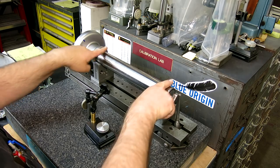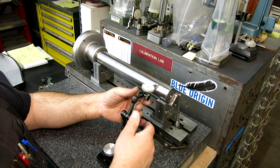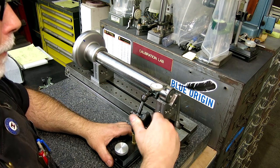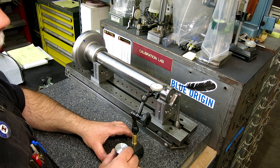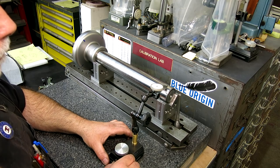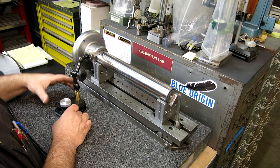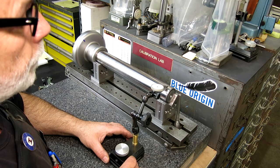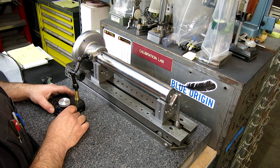So right now, what I want to do is go over the top of the pin and make sure it's parallel with the base here. So let's go ahead and do that. Use my little handy dandy converted semi noga deal here. All right. Find the high spot right there. Zero up. All right. Let's come down here. Okay, so that's plus two, plus 1 3/4 thou. So it's off a little bit, which is not surprising. Like I said, I didn't go nuts when I made those V-blocks.